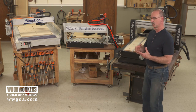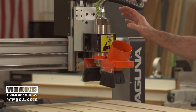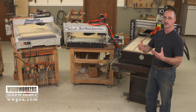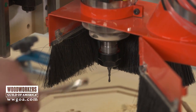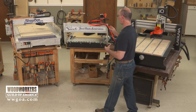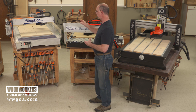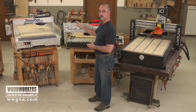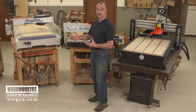What are we connecting to? It's pretty familiar stuff. The machines have a router or spindle mounted in them, and when you look at those you'll be very familiar with it — it's very much like a router motor in a handheld router or a router table you've probably already used. On the end of the spindle there's a collet, and into that collet we can put different router bits to create different cuts. As the computer feeds the signal, the x, y, and z-axes are controlled, so you'll see the machine moving back and forth, left to right, with the spindle moving up and down to create all the different cuts.